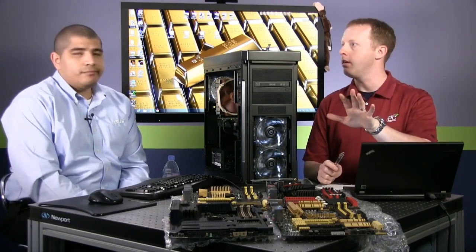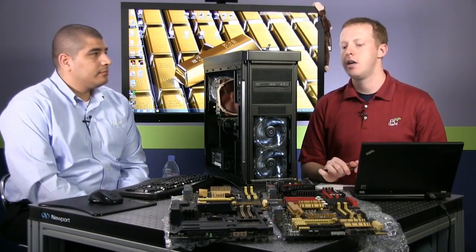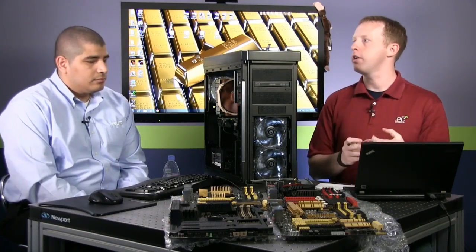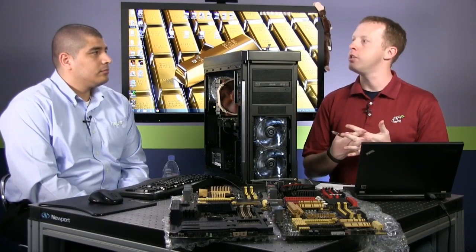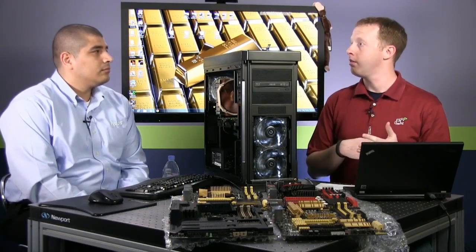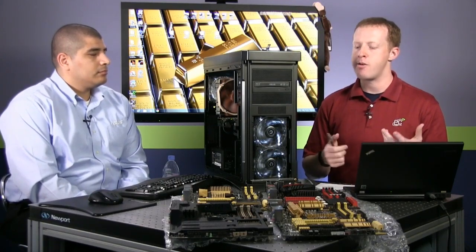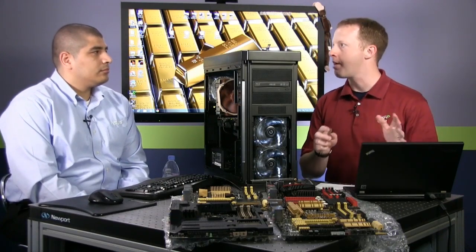FIVR, which, by the way, is a fully integrated voltage regulator. Yep. This is something that Intel moved from board design onto the silicon of the chip, so instead of sending 4 different voltages into the processor, essentially you're sending 1 as a motherboard vendor. And then internally, it divides up the power between the CPU cores, the memory, the ring bus, those types of things, the graphics. Right.